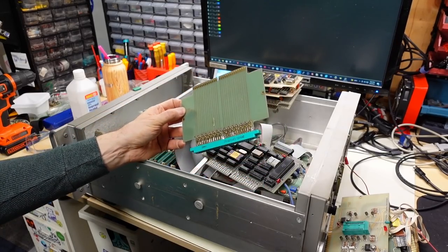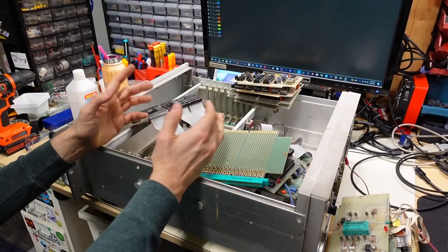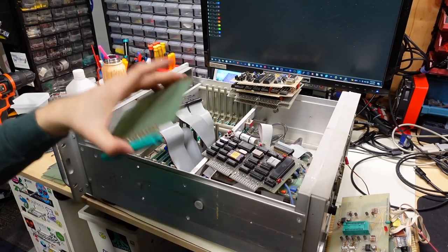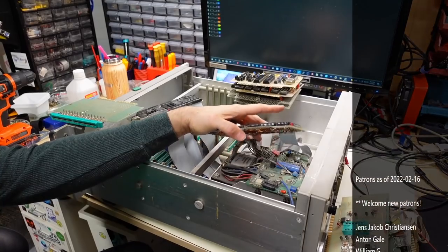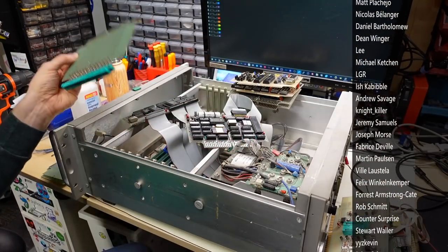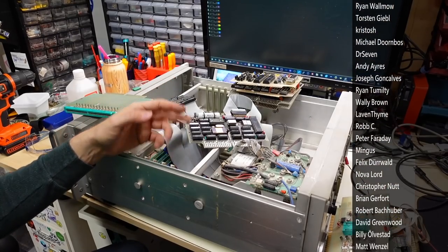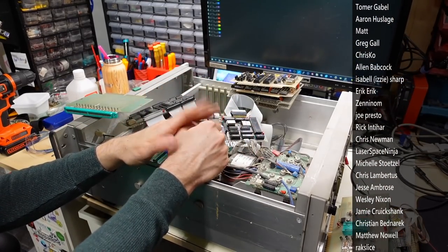So yes, that's this fascinating machine. I'm definitely not going to trash this machine, but it may be a project for a future time. Obviously if I could figure out the power supply and the voltage rail — what type of bus connector this is — I could at least get this thing powered up with some rudimentary cards to see if those ROMs start to boot the Z80 CPU. I can connect logic probes to these bus connectors here. There are little posts on here, very easy for troubleshooting — you just clip right onto there. So yeah, if anyone recognizes what this might be, that would be incredibly helpful. If you could find documentation, schematics, or any other info that exists, that would also be super helpful. If you like this video, thumbs up — if you didn't, you know what to do.